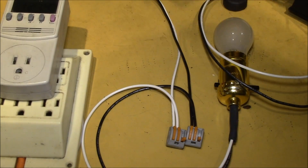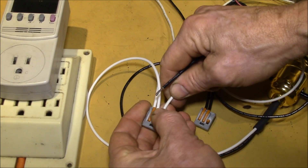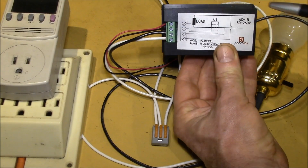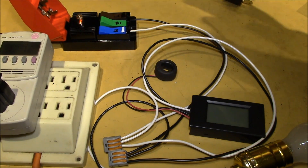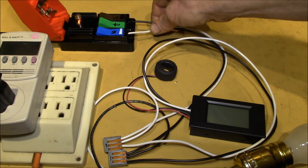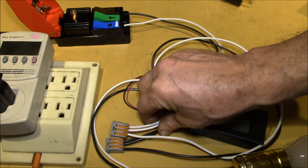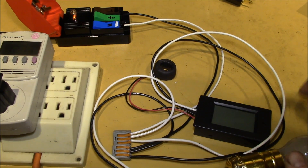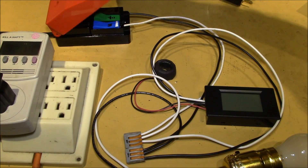I'll get rid of my junction box. I've got my two terminals — maybe wire nuts, but I'm using Wago lever nuts because they're really easy to work with. I've now hooked up this part of the circuit. I've got my power plug going into my quick test, simulating the circuit breaker feeding this circuit. Here's the incoming power going to my junction box, the load hooked up to two wires, and the panel meter hooked up to the other two wires.